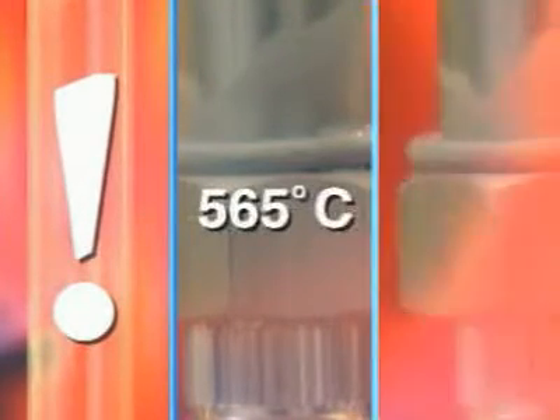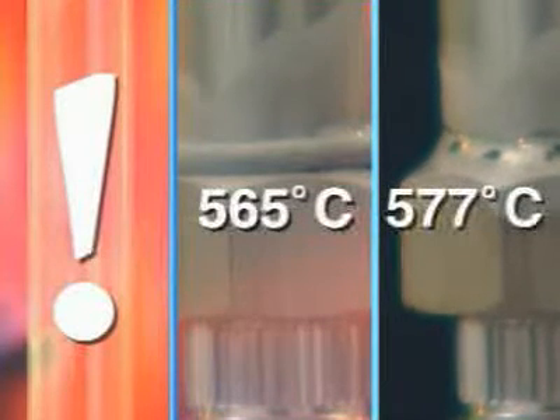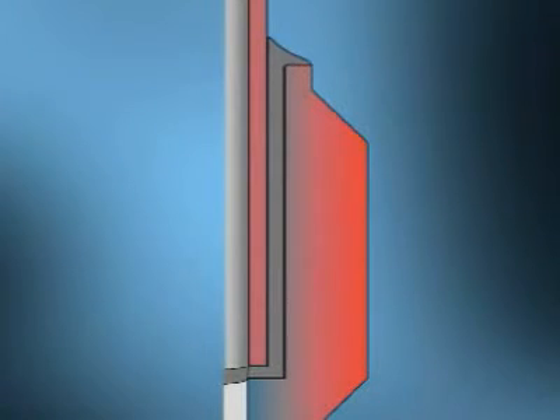The second indicator: the white area covered with flux becoming transparent indicates a temperature of 565 degrees centigrade — the flux is now starting to melt, and the flame can now be pointed directly at the brazing surface. Shortly after the flux melts, the filler metal also loses its shape and melts at about 577 degrees centigrade — this is the third indicator. As soon as the filler metal has completely melted, the flame should be immediately withdrawn. In the molten state, the flux dissolves the oxide present on the aluminium surfaces and prevents further oxidation, wetting the surfaces so the filler metal can flow freely by capillary action.